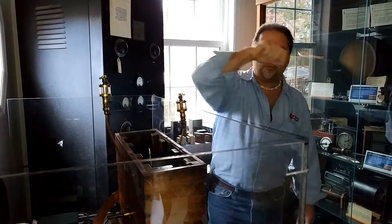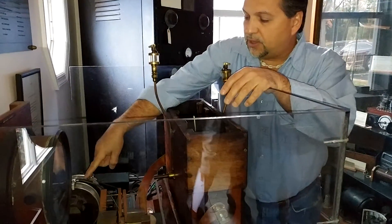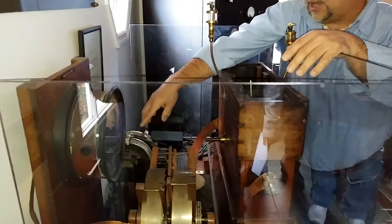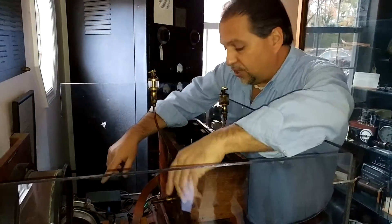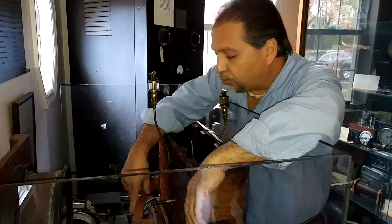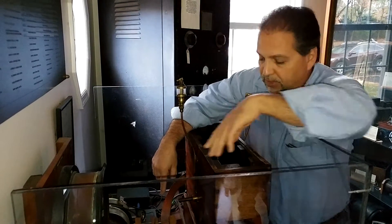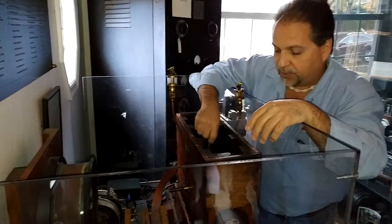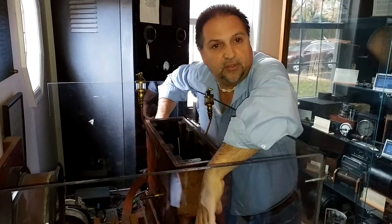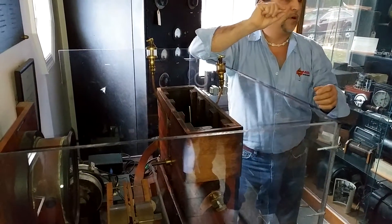What I do now is key it from over there, sending a 12-volt signal to a triac here, which puts 120 volts on the high-voltage transformer. That generates from 11,000 to 12,000 volts AC. That voltage is placed on these two points here through the condenser capacitor and one half of the oscillation transformer. The four-point armature is spinning about 2,500 RPM, coming very close to these two points without actually touching them — essentially making a very small spark gap.